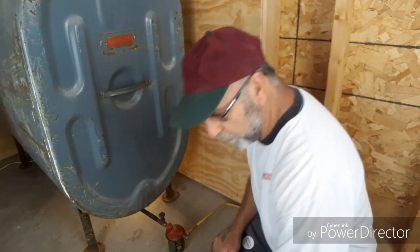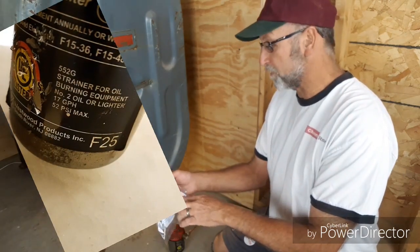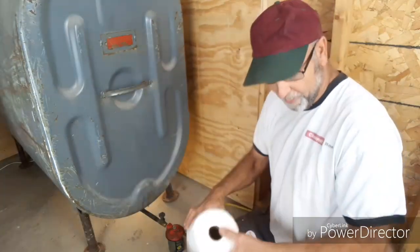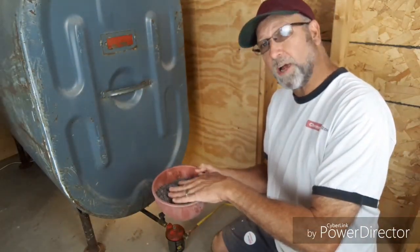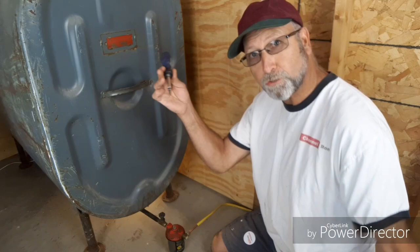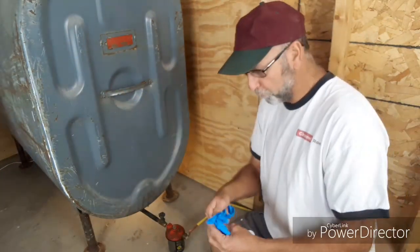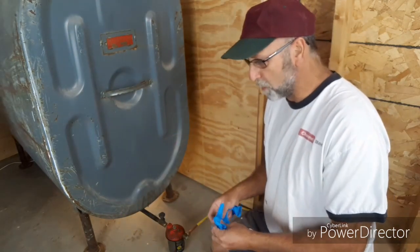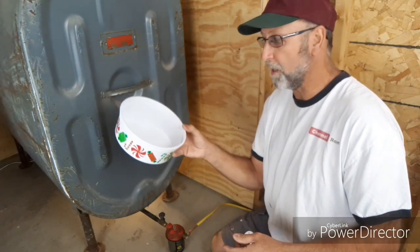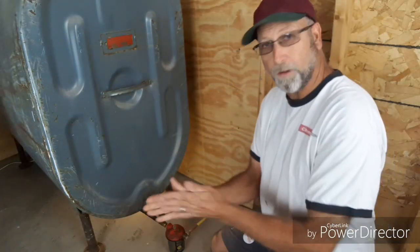You're going to need a few things. You're going to need a filter first of all — on the side of the canister it'll tell you what type of filter you need. This one is an F25 filter. You're also going to need some paper towels, some Speedy Dry just in case, a regular screwdriver, a 5/8 wrench, some gloves if you'd prefer, some newspaper, and some sort of container to put the excess oil in when you open up the filter.